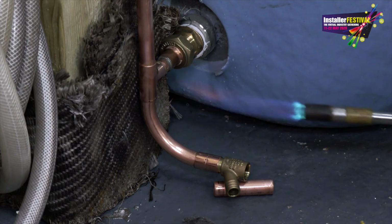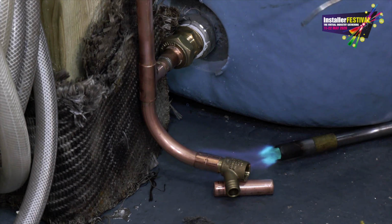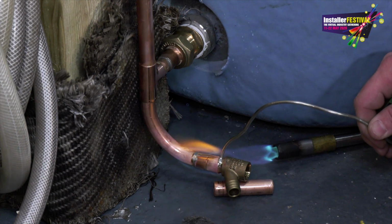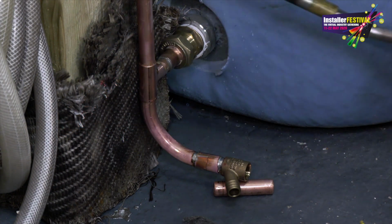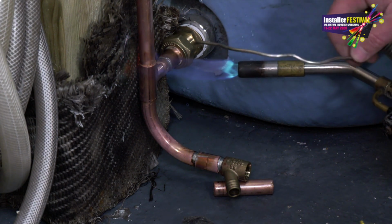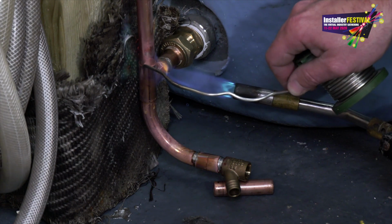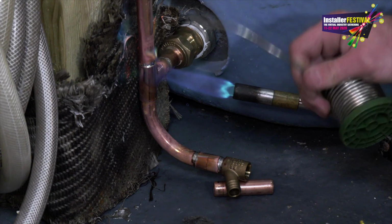It's standard procedure really when it comes to soldering. I know a lot of you guys like to have solders where you can't see any solder whatsoever, but I just don't subscribe to that. I just love to see a little bit of solder, make sure that we don't have any leaks. Even though I did make a bit of a mistake here, you'll see a tiny bit of snot on the back of the downward run of this tee that I'm doing, and that's because I didn't wipe off the excess flux on the downward part of the pipe, and that always encourages the solder just to run down there. So always remember, once you're about to do any soldering, when you've put all your fittings together and they've all been fluxed up, give them a bit of a wipe first before you put the heat on and the solder in.